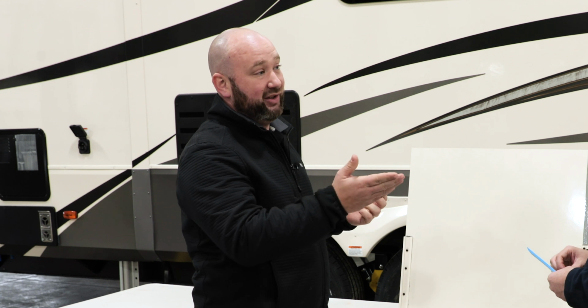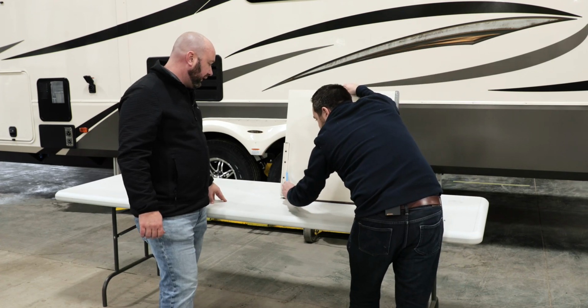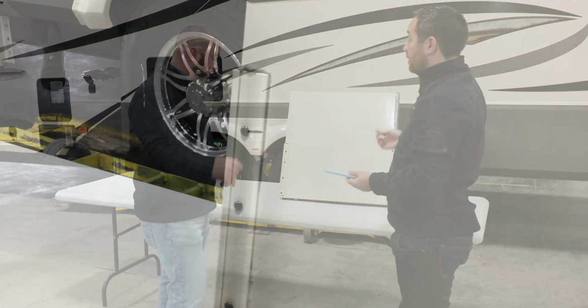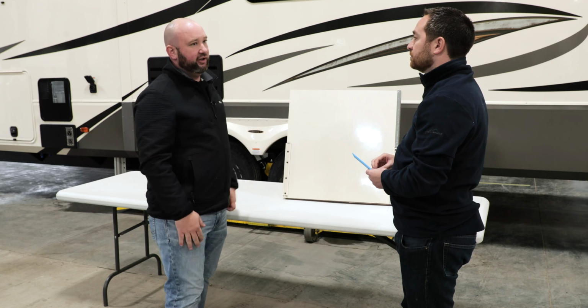And it won't be solid all the way around, but it'll be wavy, and so you're gonna have to, especially during the summer, go through and maintain that, because in any areas that have caulk, which will be most areas, you're gonna have caulk voids where the water will get in. So I got done with one section, then I gotta go do this somewhere else. It's something that's gonna continue to be a problem year after year. Especially your first 2-3 years, it's going to be a major problem. After that, it might slow down a little bit, but it's going to continue to be a problem.